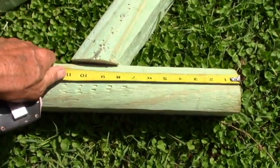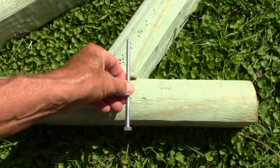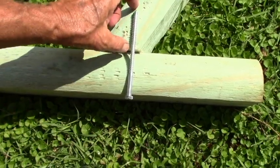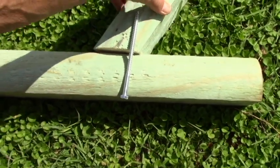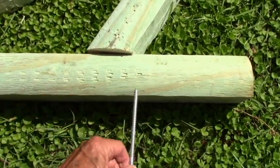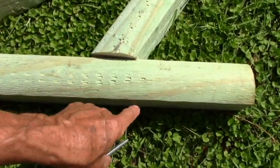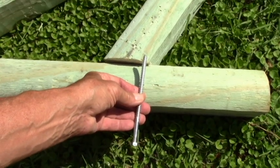When I'm laying this out, I'm going to set this inside corner at eight inches — this is for the upright — and then I'm going to run two screws. The reason I'm using two is to keep this vertical from having any tendency to twist. This lower piece will be piloted so that the screw can slide through the pilot hole and then be anchored into this one. The pilot for this lower one will be large enough that the threads slide through the hole and not bite into it.